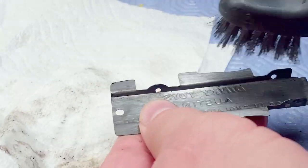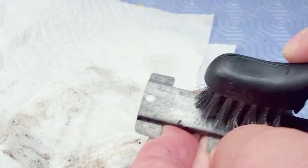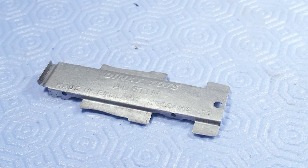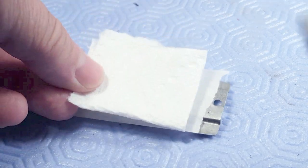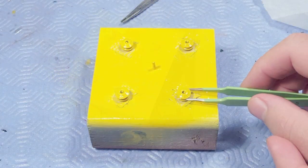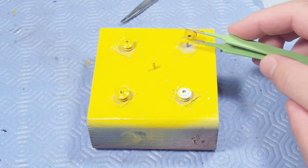I hit it with the brush a little bit. My bases, because of the Evapo-Rust, come up beautiful. This one is in pretty rough shape and won't ever be perfect again, but it's going to be good. Here's my trick: I use a magnet to hold the base — it's made of steel so the magnet holds it — and I paint that side with non-stick baking paper underneath.